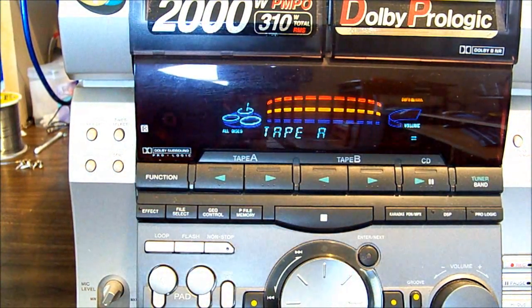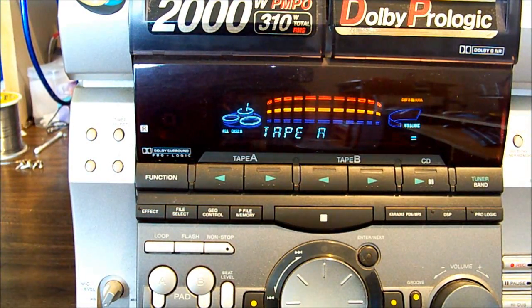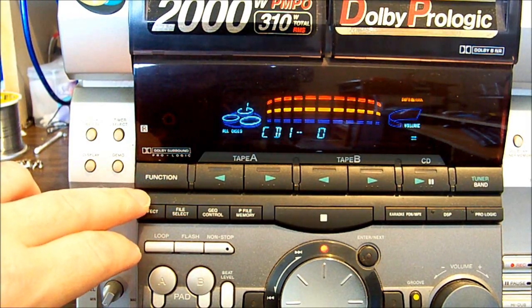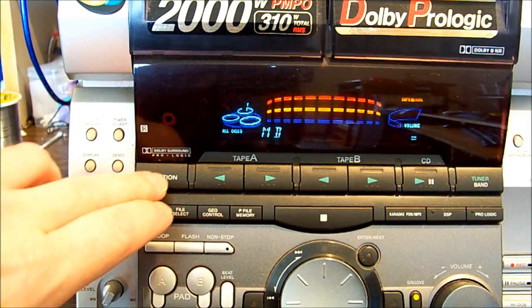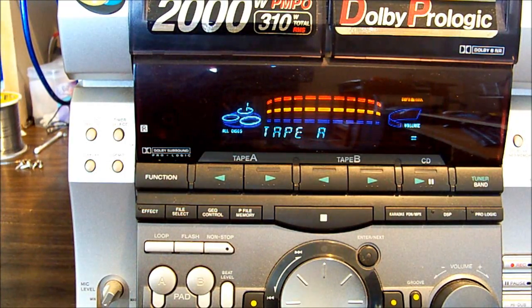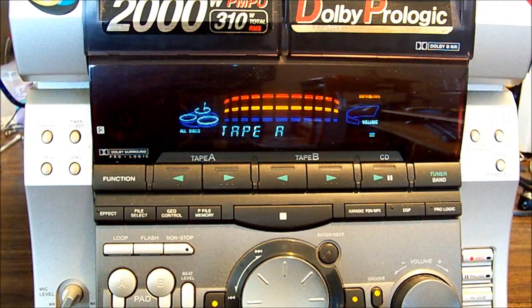One last thing, I thought I'd pull the cable to the cassette deck off, the little flex connector that controls it, and it is now staying on. And go to, say, CD for example, then go back to tape, and having the flex connector disconnected appears to have confused it into thinking that everything's in a reset condition and is all good. So it might be easy just to leave that off. If they don't want tape, then they can use it for a CD player or a tuner.